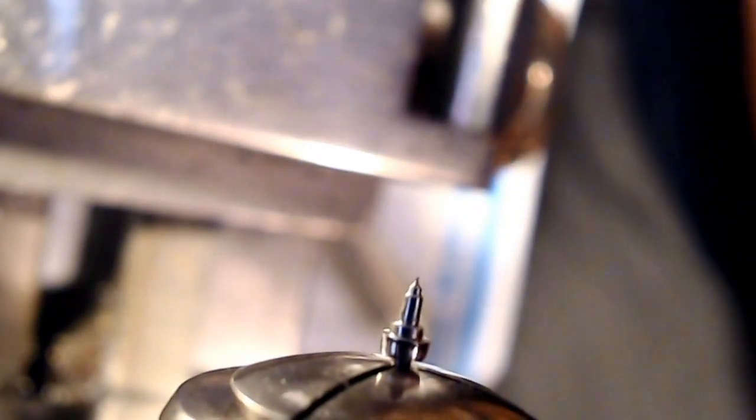What I did is I used a stone like this, holding the stone very carefully. I remove material from the pivot by rubbing back and forth like that. That work I did after I had used my very precise graver.